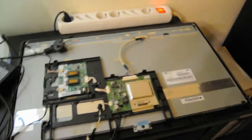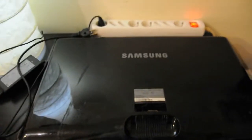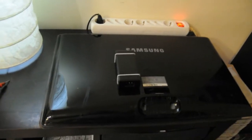Now you see, my problem is that I hate the slim screen designs with external power supplies with all this wire mess going on. They are more reliable as 95% of the problems are caused by filter capacitors going bad, but for me, all this has to be in one piece.